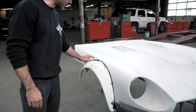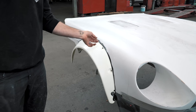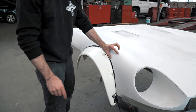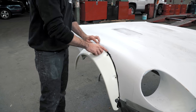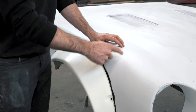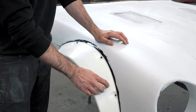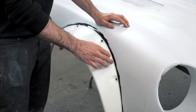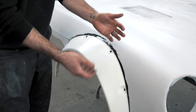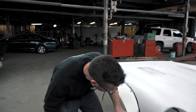So we got this nice tapered edge where the old part and the rest of this will basically be the flange meet. Because with a little bit of wax on top of this, it'll be perfect. It's kind of annoying when you make a part and you have to add the filleting wax to the edge and make sure, because if any of the gel coat from the mold creeps around there, it'll do a mechanical lock and the mold won't want to come off the piece, or it'll get cracked and destroyed taking it off. So this will just make it easier to pop the mold off.